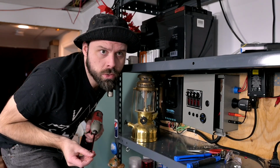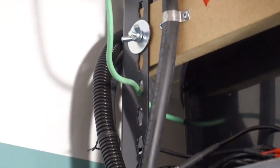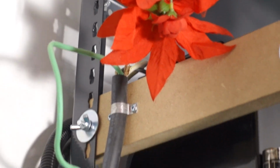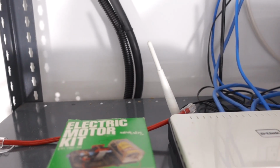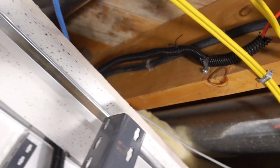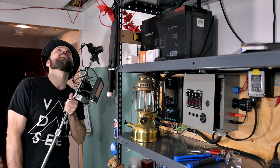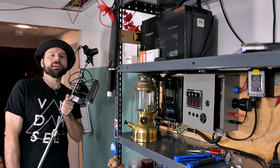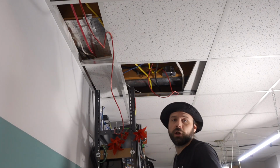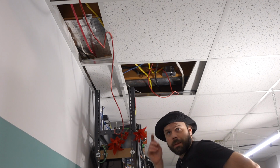Okay, it'll do. So she comes out of the box, straps on right about there, and then zip, zip, zip. Oh, she's hiding from that point, bud. Over here by the internets, it comes up into the general ceiling area. Strap there, cut, and there's our wire. So now we can go ahead and officiate that wire into the doorbell circuit, which doth involve cable management from this point, where I will zip tie it to the solar line that passes through.